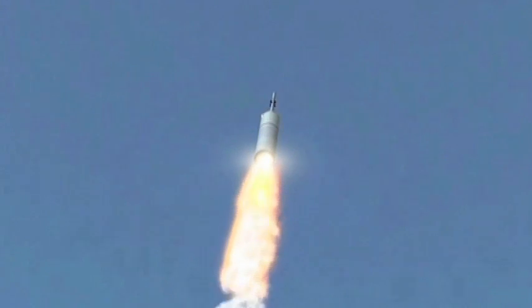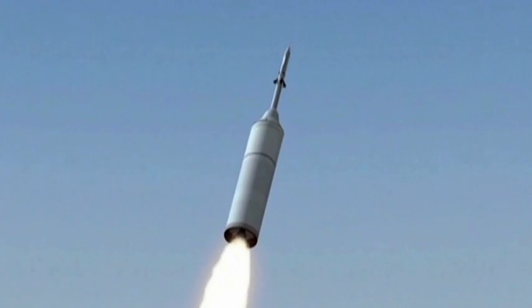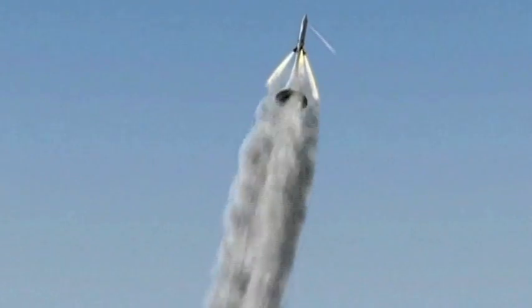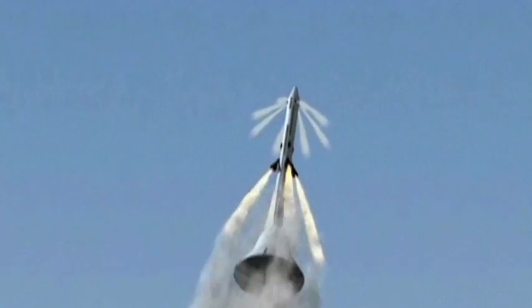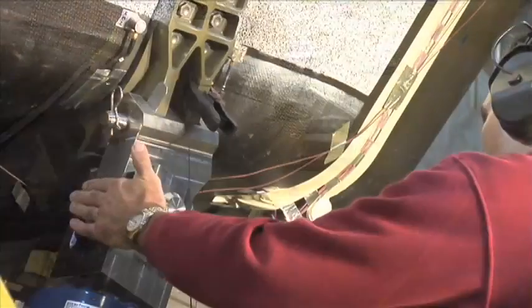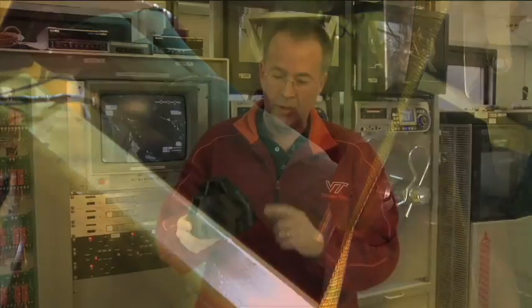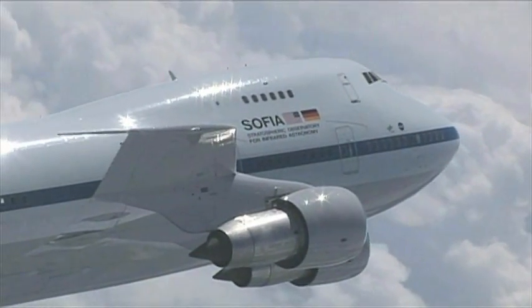We also have a launch load case where the vehicle is accelerated vertically at about 3 to 4 Gs. We have an abort load case — if something's going wrong with the rocket underneath us, there's a structure mounted above this vehicle with rockets on it. If they sense something's wrong, they fire those rockets, release us from the spacecraft, and this structure gets accelerated away at about 17 times the normal force of gravity. To give some idea of the load: the average car weighs about 2,500 pounds, and each of these fittings can withstand about 70,000 pounds — like 35 cars hanging off one fitting. All six fittings are loaded at the same time, so total forces are in the 400 to 500,000 pounds range — roughly a fully loaded 747 — and that's the total force this vehicle has to withstand.